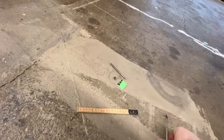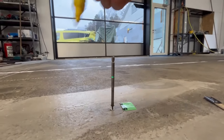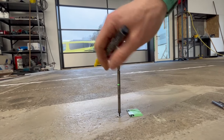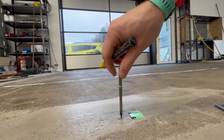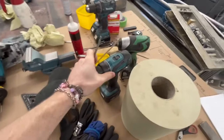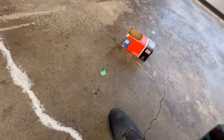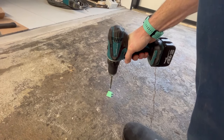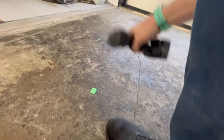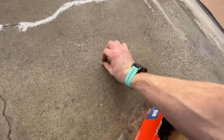It should be 5.8 — a little bit further down — there we go, now that one is perfect. Since I know this one is perfect, I put a mark there on my bit, all the way around. I take the drill, put the bit in, bolt it down — perfect. I'm just drilling down until I'm on my yellow mark, then I know the height is perfect. On top of the bolts we put really sticky tape, because when we float it's going to be so easy to see the marks.